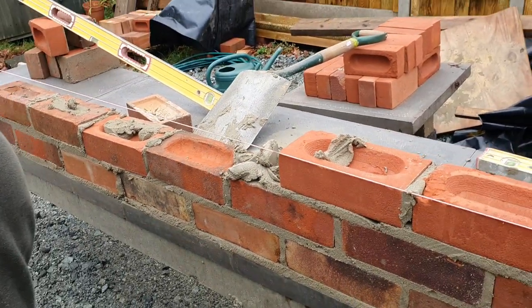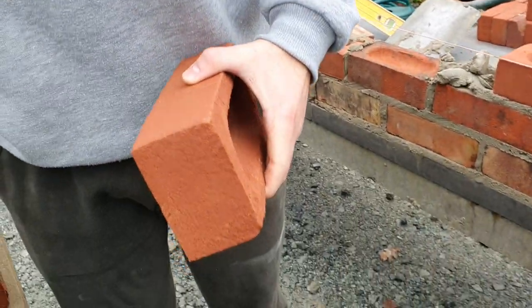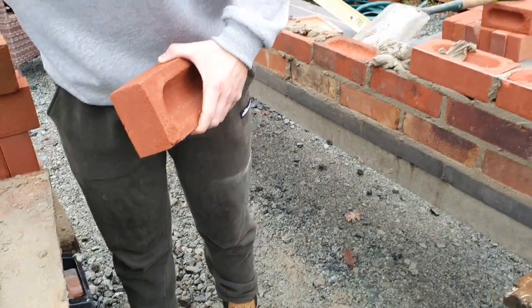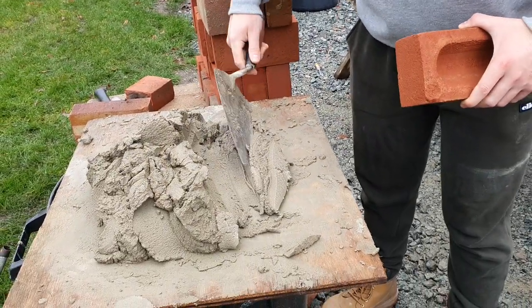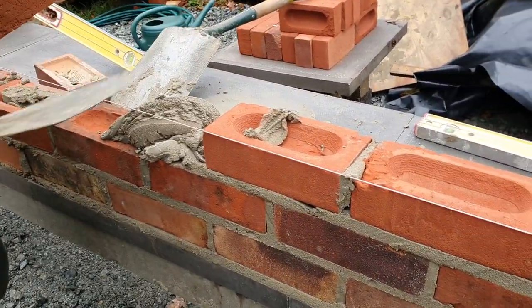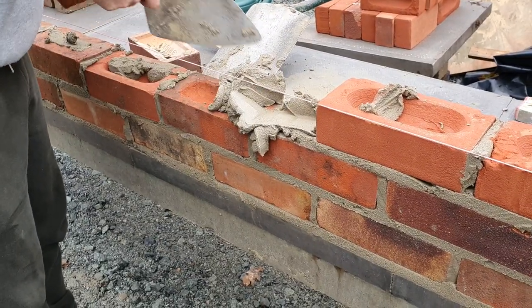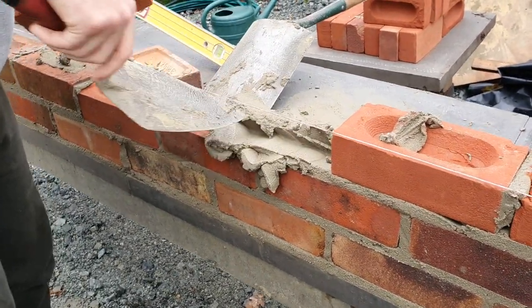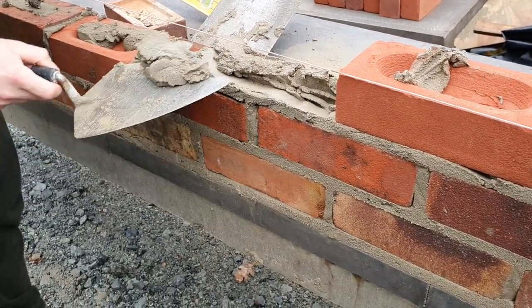So on the neck, when you get your brick next time, get your brick and push it to it, okay, rather than just slide it down, if that makes sense. That's it. You can do what mess you like at the back, because that's the back of the brick, that's the face we've got to keep tidy. That's better, yeah, that was right. Yeah, don't go mad.